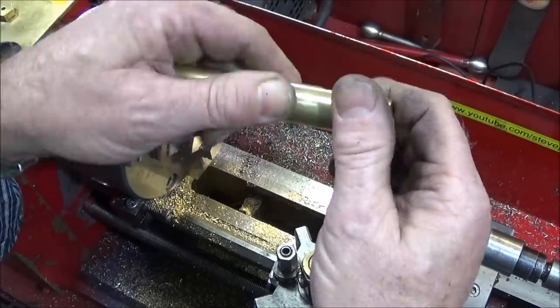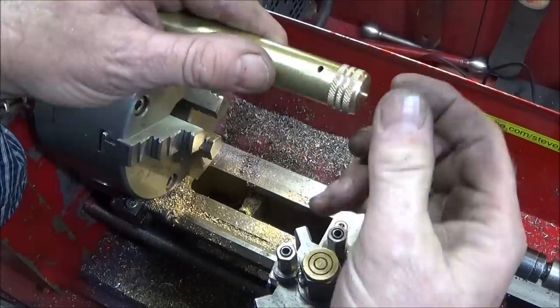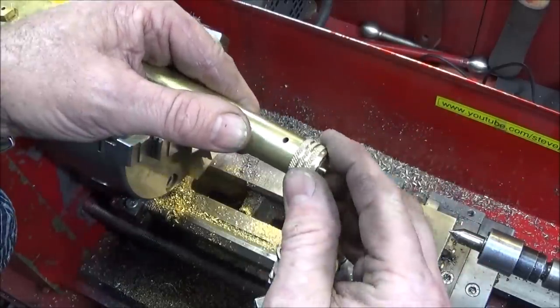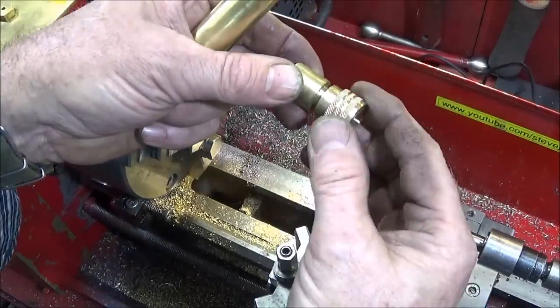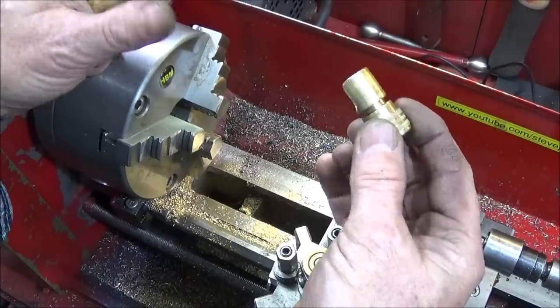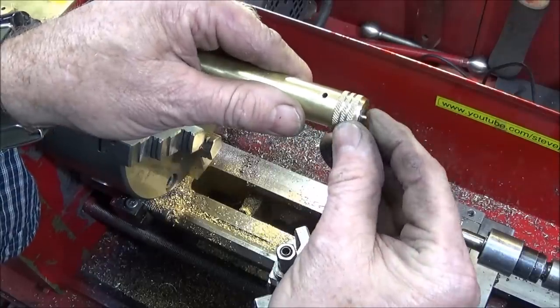open, close. And when you put the component in, if you sight down through the roll pin hole and you can actually see the diameter of the groove, then you might have to take a little bit more out. I had to do that with this one, take another 25 thou out so that the roll pin can clear that diameter and push right the way through.